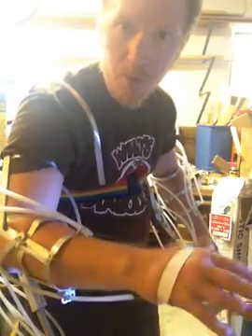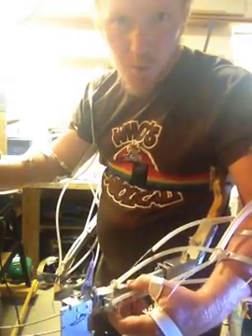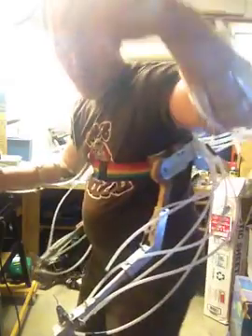But whenever I tried to make it so that a rotation of my forearm causes this forearm to turn, the forces were too high for such a small radius that it goes around. You can see how on the shoulder here, I've got a nice large radius that the wire pulls. So that makes it much easier.